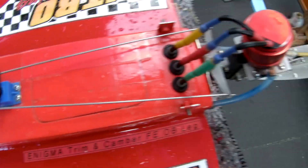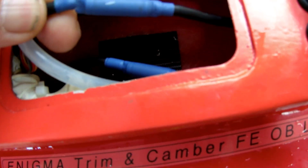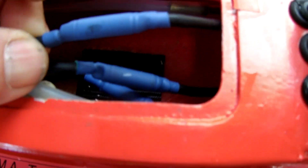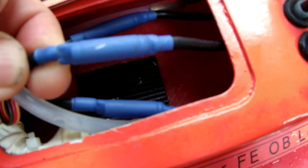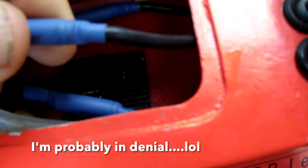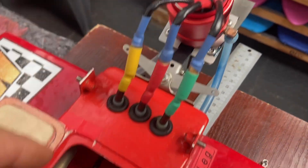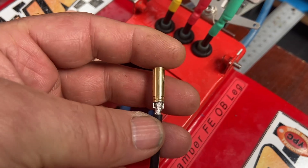We continue to blow that 3-phase wire - it's the usual culprit, the middle wire, the third wire. I don't know why that is. I'm going to write this off to a poor solder and try to re-solder it because the other plugs look great. It could even be a fault on the motor, which is an old motor - I took this out of the Morrissey Surfer. I'm going to take that out and repair it. The other side looks fine.